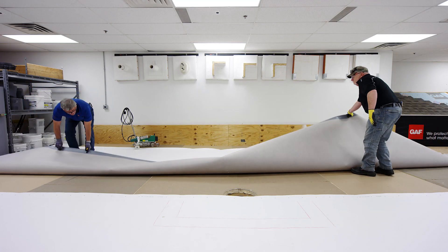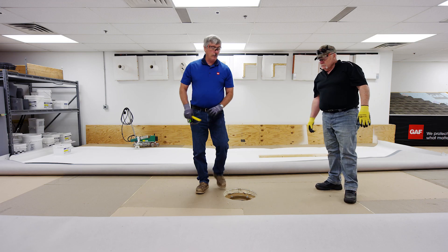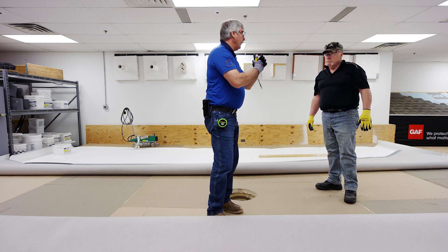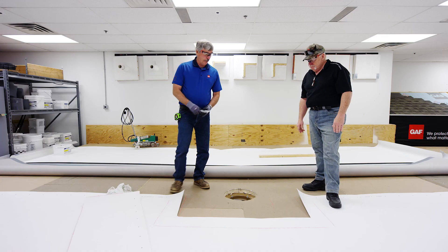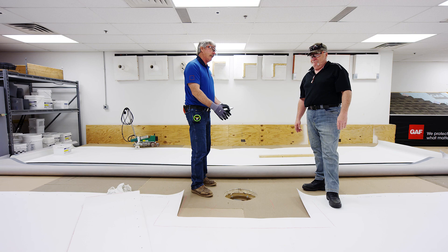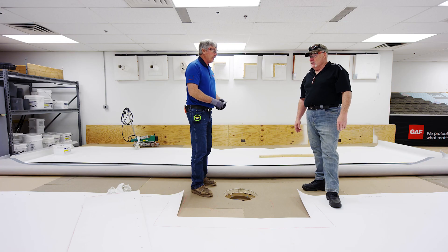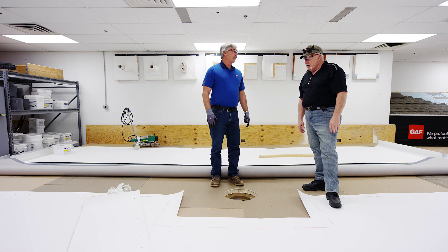Let's pull this back and expose the drain. There's how our sump fits. Again, we're talking about the fleece — we can't have the fleece come in contact with that bowl. So we went ahead and got this cut out. We marked the ISO again just in case you're already doing an adhered system — the crew coming down through here needs to make sure they don't glue this area, especially for your targets. You pull that up, you're going to have issues. Now, we want a five-by-five target. Could you go smaller? You can, but if you have a severe sump it's going to be harder.